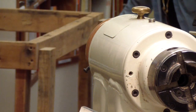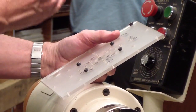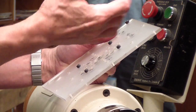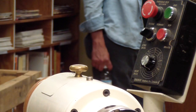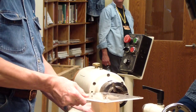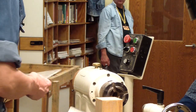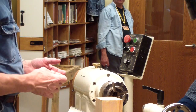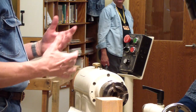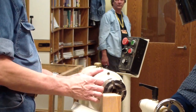If you do have a piece that is off, and you know what side is off and where you want it — the center holds the big. Let's say it's off an eighth of an inch. If you pick up an eighth-inch shim and stick it on that side right there, that's the fix. Rotate it around, hold it in place, and that centers the point. Every once in a while, somebody comes in with a table leg that is not square at the top, and you have to figure out how you're going to do it.